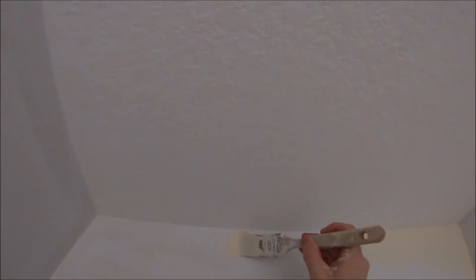I find that flats have the nicest finish. There are ones with an eggshell or a soft gloss — I'll use a soft gloss in bathrooms or sometimes kitchens — but for ceilings and walls generally throughout the house I prefer a flat matte finish, no sheen. You're following the same principles every time: start with your brushwork, feather it out, don't put it on too heavy. Your first coat is a good light coat as a base over your primer, and the second coat finishes it off. Paints that suggest you only need one coat — I typically have not found that sufficient, so always plan on two good coats.